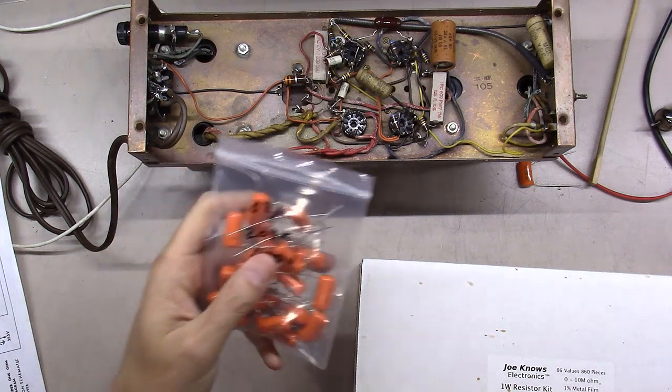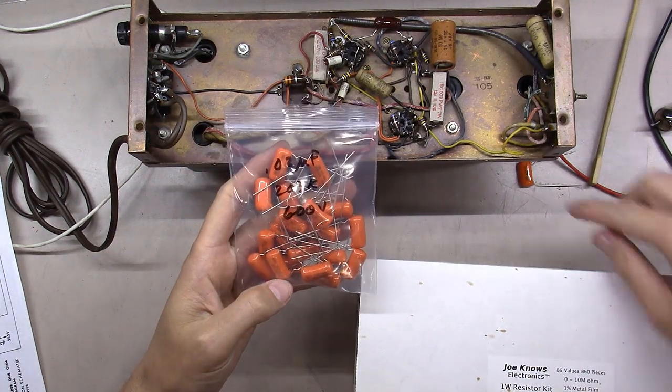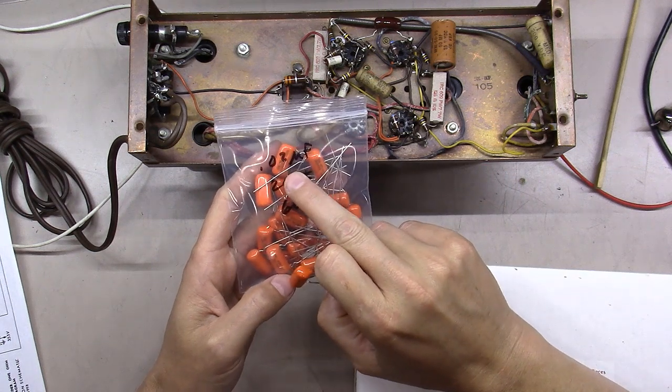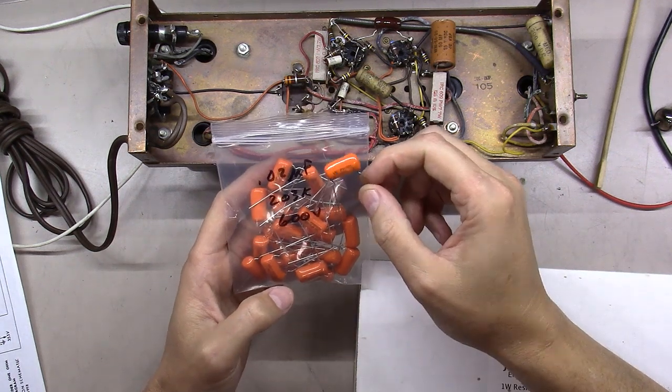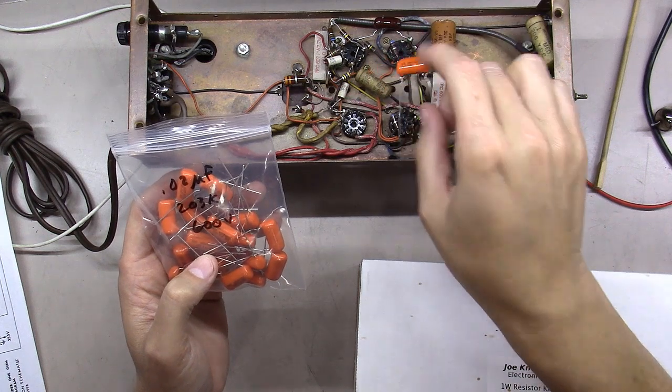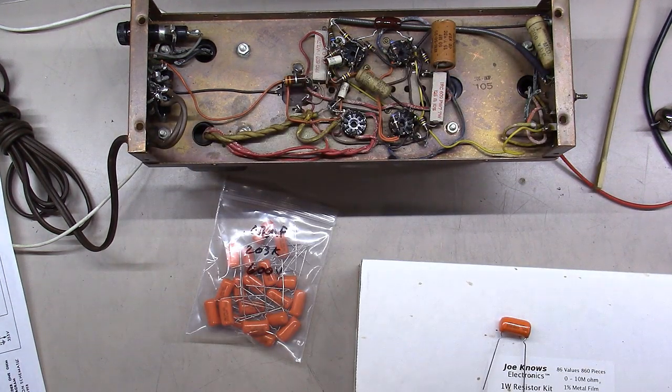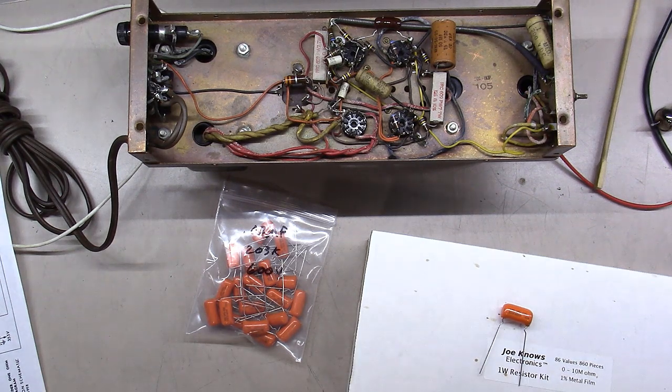I've decided I'm going to use some orange drops, 0.02. I actually have in stock 0.02s instead of 0.022s, which is exactly what's in here now. So I'm going to use some orange drops. I've got some electrolytics for that, and I've got some orange drops for this as well. So I'm going to do that, and I'll just show you the end result, and then we're going to get on to the next video of showing you how to troubleshoot problems. That's really what this series is about.